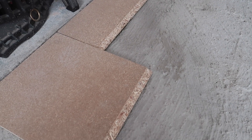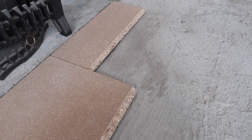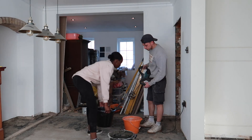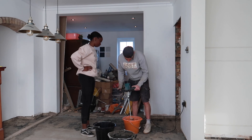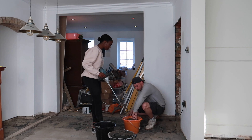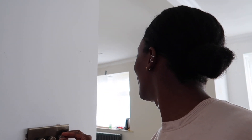We're going to put the chipboard down — just to show you guys what I mean. These are some spare chipboards we have. The idea is that the chipboard goes on top of the original floor, then we'll put plywood boards on top of that, and then install the luxury vinyl tiles. At the moment we're trying to figure out what's the best way of doing this.